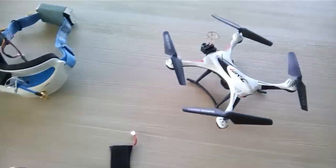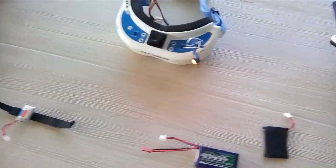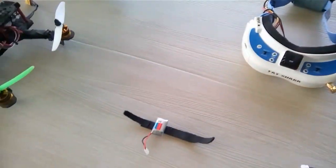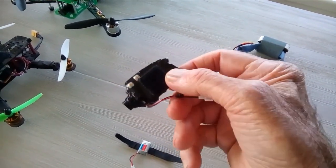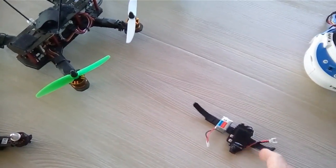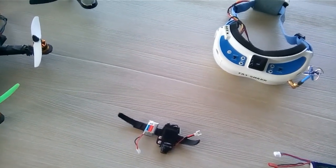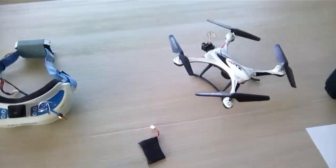These ones don't come with a camera for recording while you're flying, so I got a little piece of balsa wood, put velcro straps on it, and just strap that around the undercarriage. Then I stick this keychain camera on — this is one of the more expensive keychain cameras with the case taken off, and I just sit it on here with velcro. I get no jello at all because the velcro isolates any vibration from the quadcopter. And since it's down on the skids, I don't get any blades in the video, so that's a good option if you want to do aerial video.